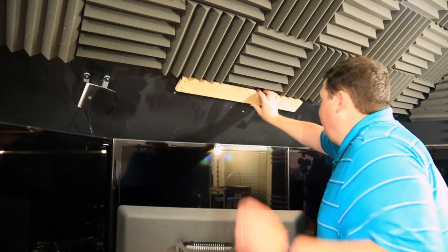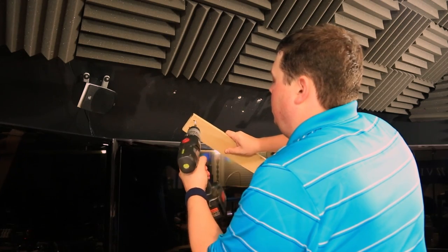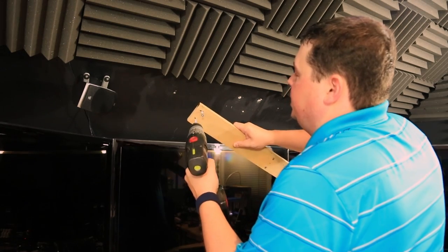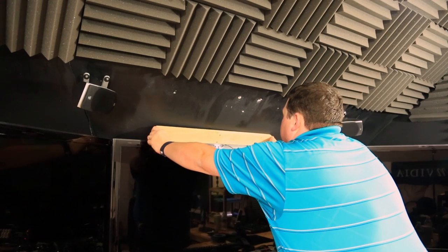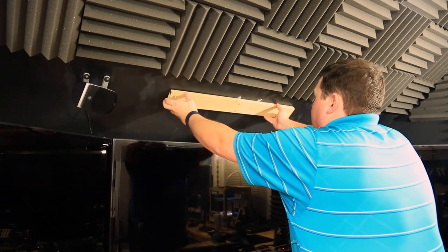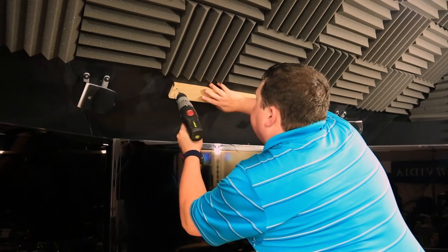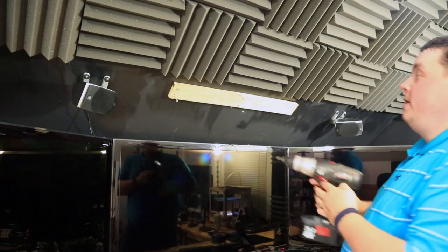So now we've got our board set up here. I'm going to center it up and drive one screw first, then level it out and put the other screw in. There's one. This is always easier when you have more people, but I don't want to bug my wife right now — it's late at night, like 10 or 11. Centering that up using the poor boy method. I'm thinking right about there is probably good, that looks pretty much in the ballpark. So I'm going to drive one screw in. I hit a stud — that's what we wanted. If the screw goes in and just keeps turning, you're not on a stud.